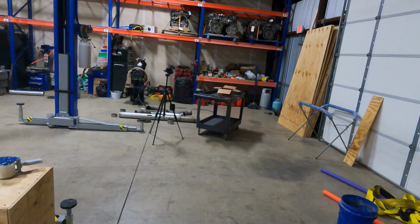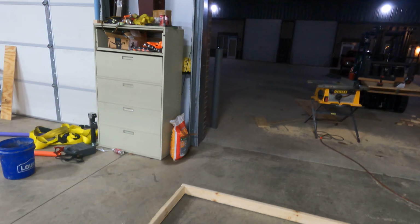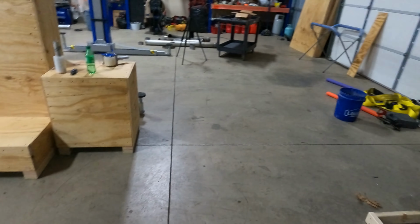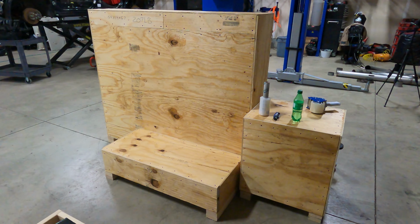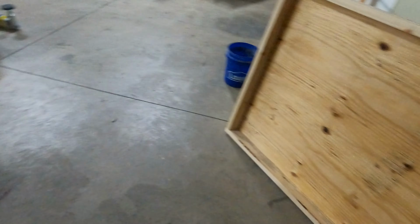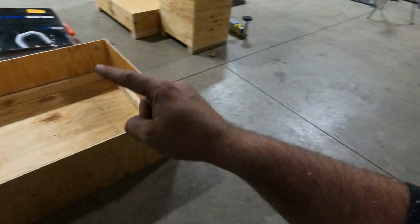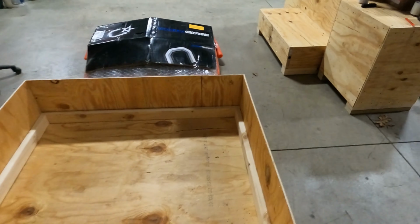But now, let's grab two sheets of plywood, rip them. Since this is 45, it's pretty much perfect, so I'll have to rip them twice, or cross cut it and rip it, and then they look just like this. Beautiful. So let's do that, and then I'll explain what I do next. The box is done, the lid is done, so all we need to do is put that door inside of here, put that lid over it, and then just put two legs, and that's it.